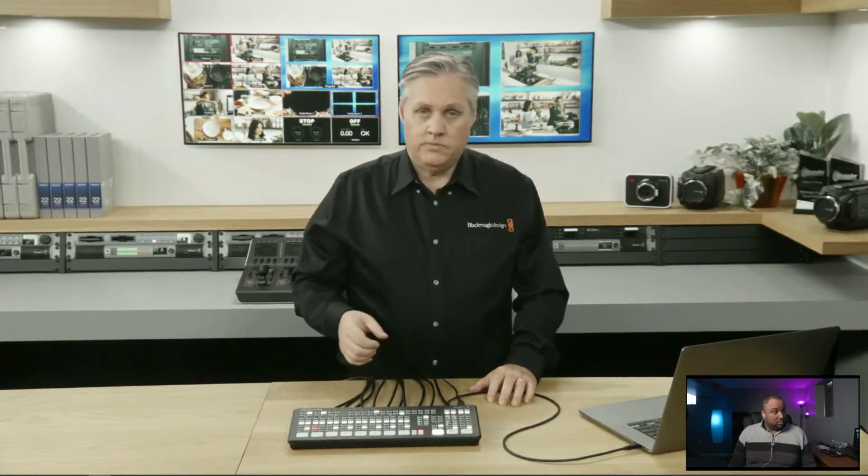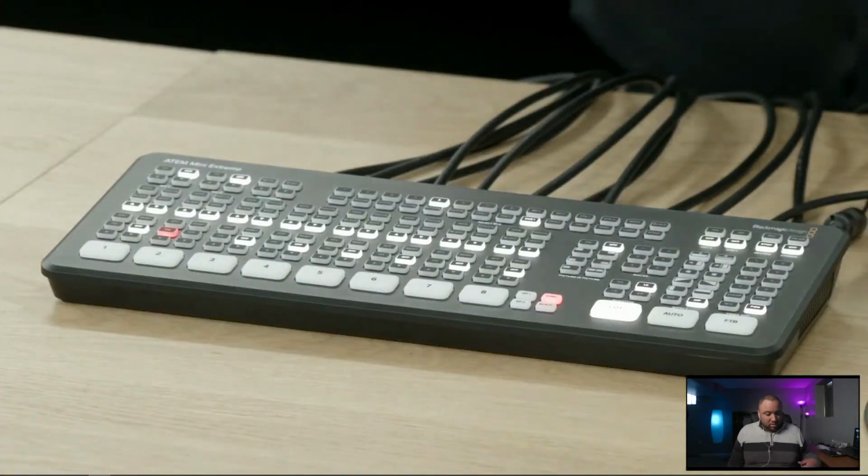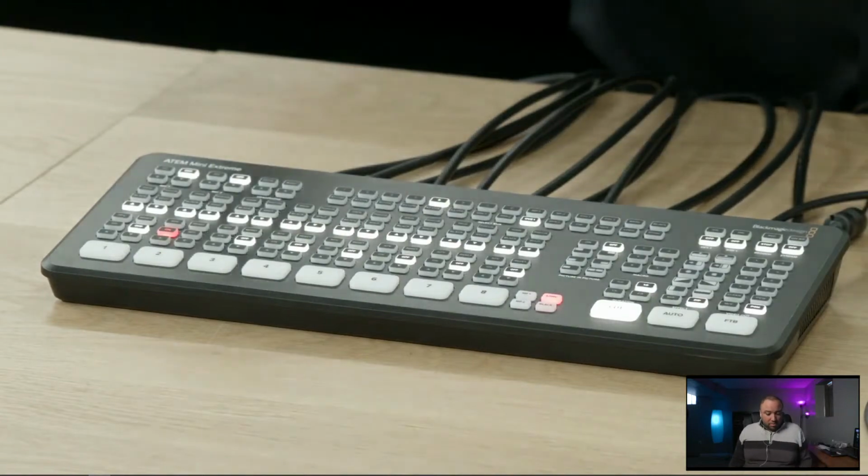They're the good keys, the most advanced keys we have in ATEM switches. There's 2 downstream keys for titles. There's 2 media players for graphics and titles. There's 2 independent DVEs for picture-in-picture effects. There's a super source with another 4 additional DVEs and a multi-layer processor. There's a select bus on the front panel. The multi-view supports up to 16 different views. Both HDMI outputs have source routing, so they work as aux outputs. There's a separate headphone connection with audio monitoring bus, so you've got separate audio monitoring control of that.